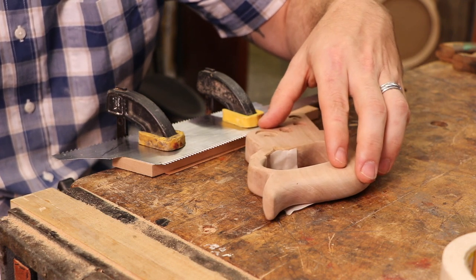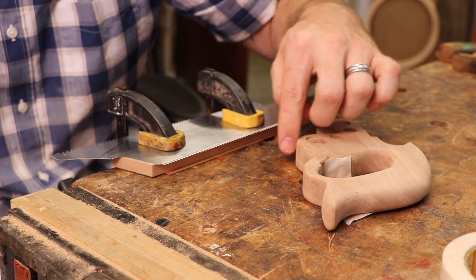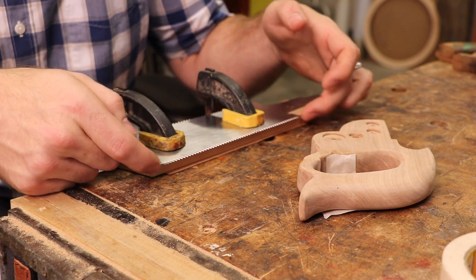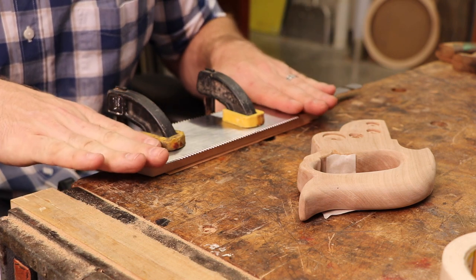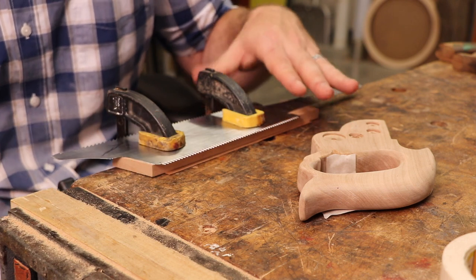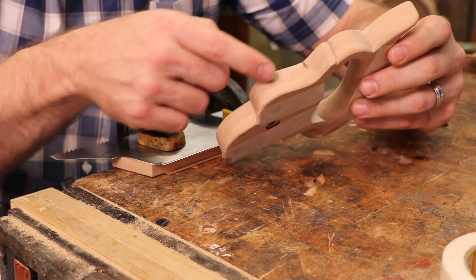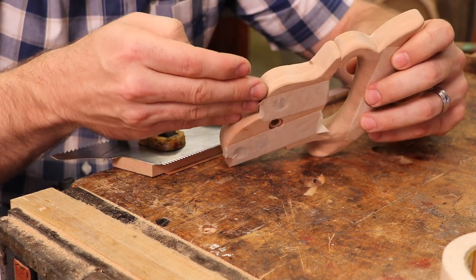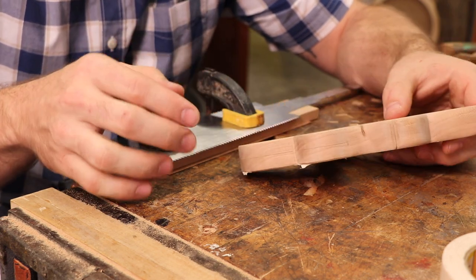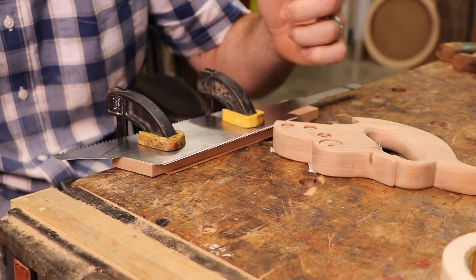And I'm gonna slide this across the blade and slowly kerf the outside of this. And then all I have to do is, the teeth are supported here on the block, and I can slowly shift this blade out as my line gets deeper. That way I have no risk of drift. I've had that happen once and it really ruined my day, where I made a saw handle I loved and I drifted that kerf just a little bit and it made the blade twist. Made it completely useless. So to start my cuts off, this is how I do them since that event.